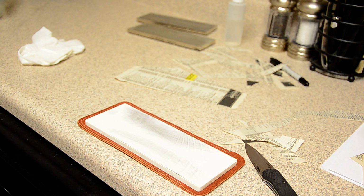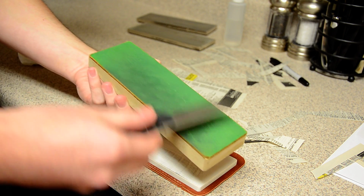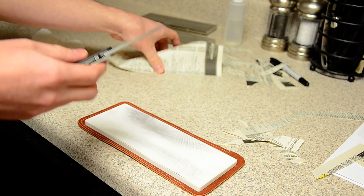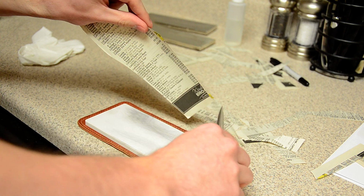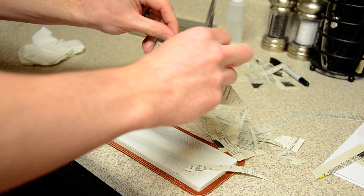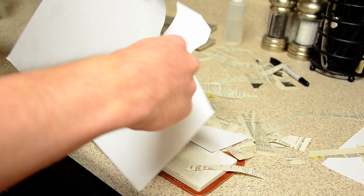That's one good thing about freehand sharpening, is it takes pretty much 0 time with the correct materials to get really screaming sharp edges that look really nice. And it took all of 3 stones: coarse DMT, extra fine DMT, and the 306 UF Spyderco stone. And it works. I mean, that is a super sharp edge. It's hard to do S-cuts in phone book paper. But printer paper, no problem.